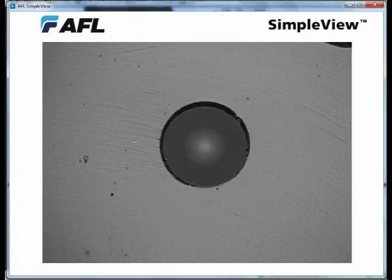The microscope also allows us to determine how well connectors have been terminated. We have here three separate patch cords, and all of them show problems. On this first one, you can see scratches on the ferrule. The fiber itself is polished fairly well, but the fiber is smaller than the hole in the ferrule by about 10 microns and is offset all the way to one side. This is why we always tell people to rotate the connector as you insert the fiber through the adhesive, because it will float the fiber into the center of the hole, preventing problems like this.